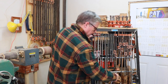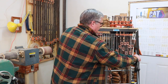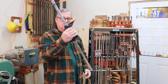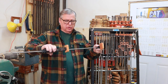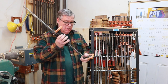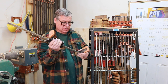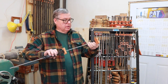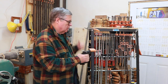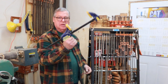These Jorgensen clamps are used quite often for quick fixtures. I only have a couple of these single-handed clamps and I don't need very many. All you need a single-handed clamp for is to hold something until you can get another clamp on it — that's how I use them. Some people might have a whole set and use them all the time. But I like that you can reverse it and now it's a spreader clamp. So if you're going to take a chair apart or work some glue into it, you can turn it around and make it spread, or make it a regular clamp. A friend of mine calls these turkey clamps because they sound like a turkey.